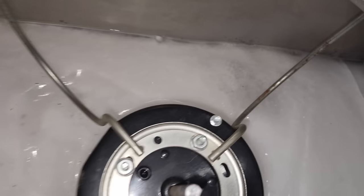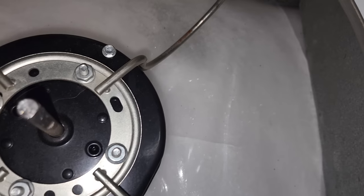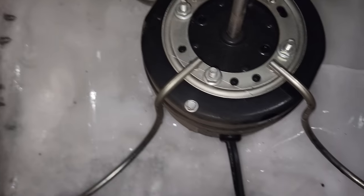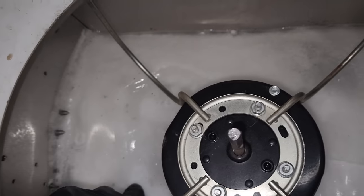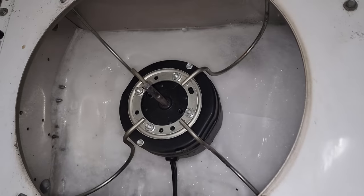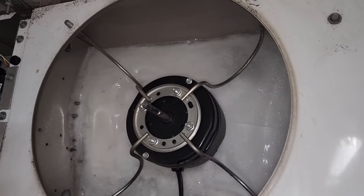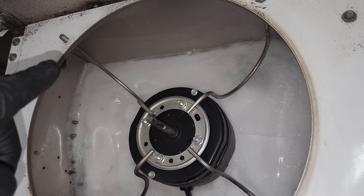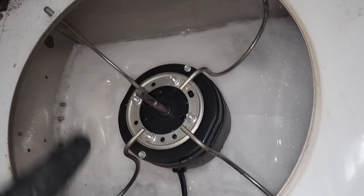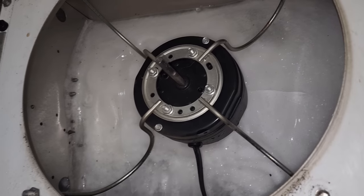The ice has a shiny, really tough, hard look to it — it's not frost, it's really slick. To me, what that means is that this has been iced up for a while. The smart controller tries to put it into defrost, but it defrosts a little bit, then it just refreezes. Then it defrosts a little, then it just refreezes.